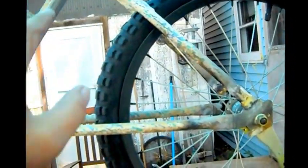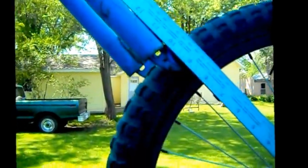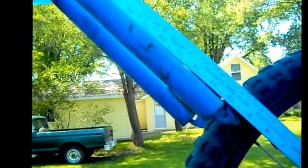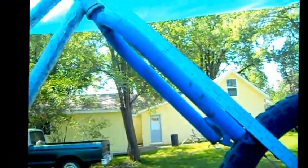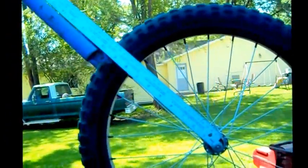I like the 24 inch frame because it's a little bit smaller. The 26 inch kind of looks awkward. The forks will come around here — this is how I measure to make my forks. I like these forks better. Those tapered ones are harder to build, because you're going up here and you're trying to find a piece of pipe to fit, and you're cutting it. I don't really like doing it, though I do it for some builds to make them look a little more different.